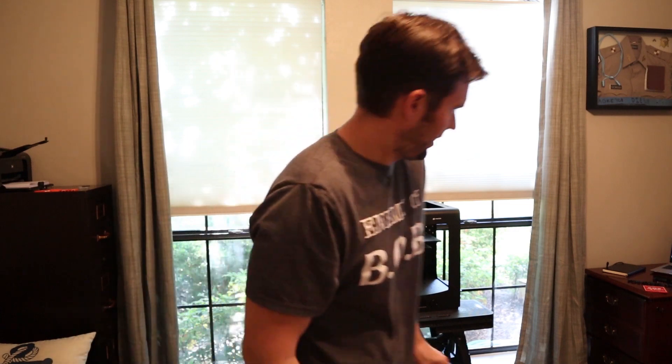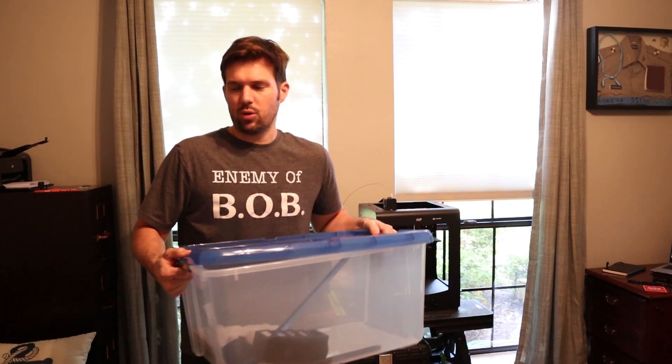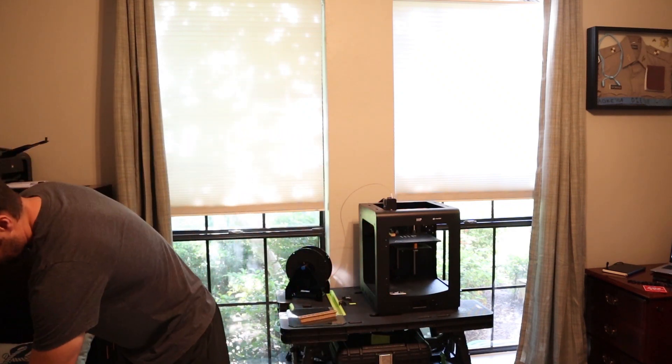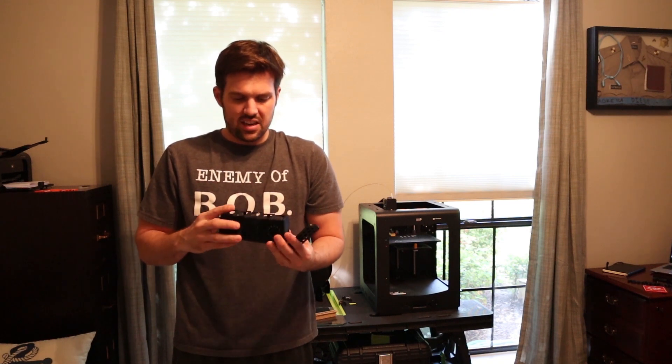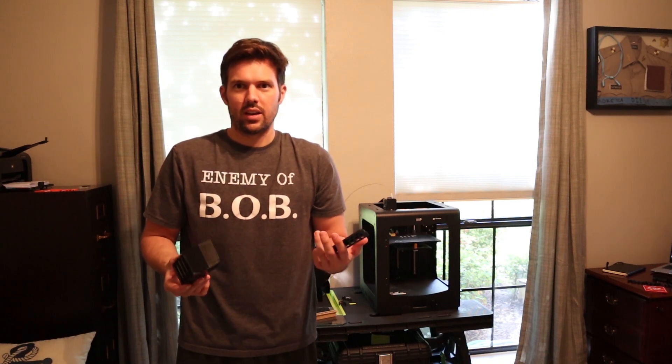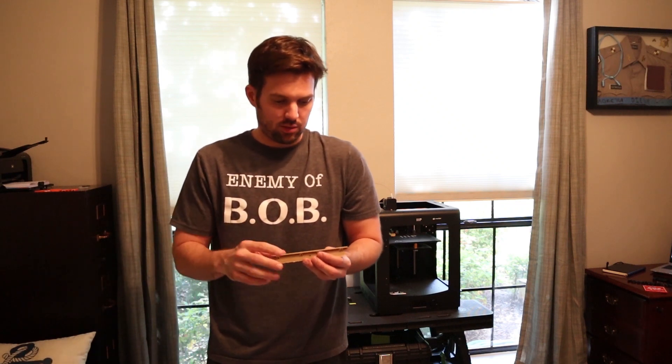And just like that, we have our part. Actually, it's not that easy. Let me introduce you to my box of Misfit prints. These are a lot of designs that, honestly, they failed. Typically what I do is once I design something up, I'll print it in cheap, low-resolution plastic and then see if it works. If it works, I'll move on and print it in the final product. This final product is actually a wood filament — it's basically sawdust mixed with plastic. And what that lets me do is I can sand it and stain it. So actually, all of my vents and a lot of other parts in the car are going to be made out of wood, which should be classy.